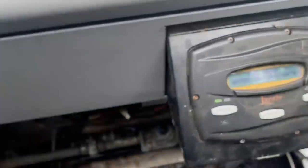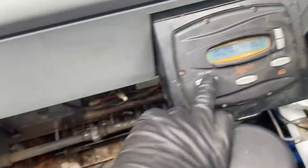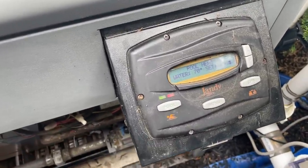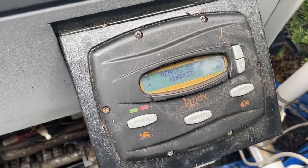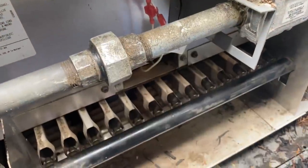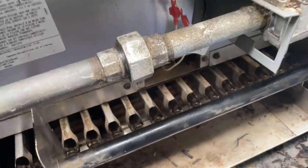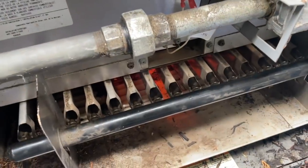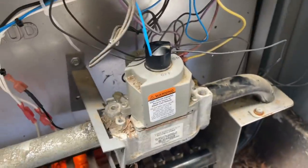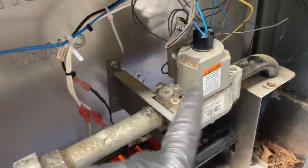All right, checking ignition control. I'm going to turn off the pool heater now, then turn it back on and error this thing out. Good, back to pool. Remote thermostat enabled — good. Shortly our hot surface igniter should come on again. Before I even got the tools, the hot surface igniter came on. We saw that, and then we heard the click of the gas valve.